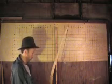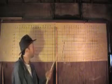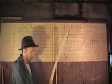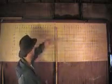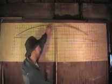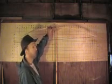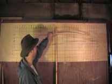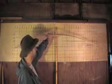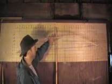Usually when you're tillering a bow for the first time, after you've brought it to the dimensions that you want to, you put a string on it that is much longer than the one here, so that when the bow is in place, you can begin drawing it from a zero draw, so there's no tension in the limb. And make sure that you work the limb from the beginning.